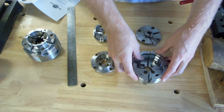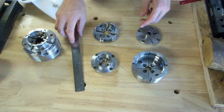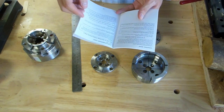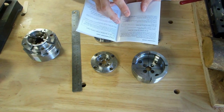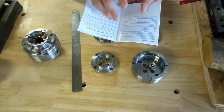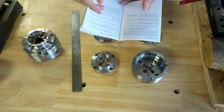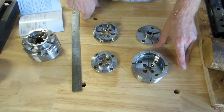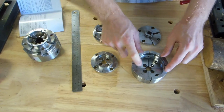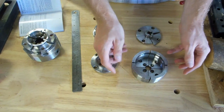Now with the 4-inch jaws, the tenon that you can grip is all the way down to about 3 1/4. In fact, I have the manual here. I want to look up what it really is, and it says that in contracting action, gripping a tenon to grip bowls by the foot, the size of the foot is between 80 millimeters and 100 millimeters. So that's 3 5/32 to 4 inches for the tenon. Given the size of the bowl that we're making, about 10 inches, I want a tenon that is about 3 1/2 inches in size. So I think we're going to use these ones because they're the closest to the size that I want for the foot of my bowl. So we'll use these big jaws on here.